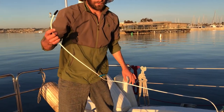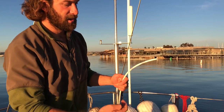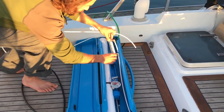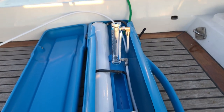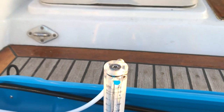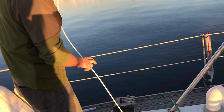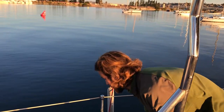I'll just direct the brine overboard on this side. And this here is the fresh water output — that's where the fresh water comes out. You can see there's a chart on the side, and then we just direct this directly into the deck fitting for fresh water. But first we'll put it overboard until we are making fresh water.